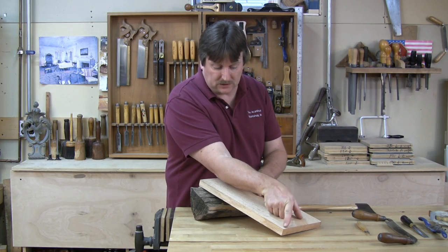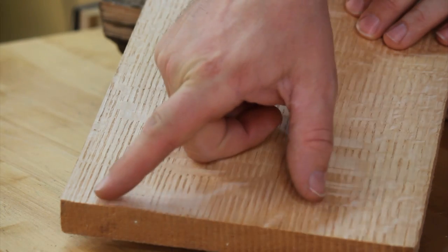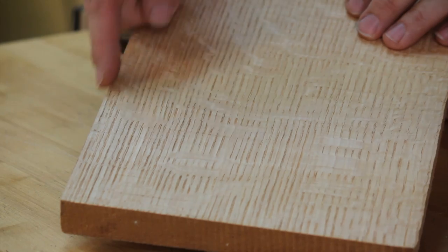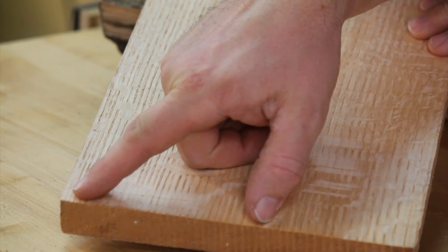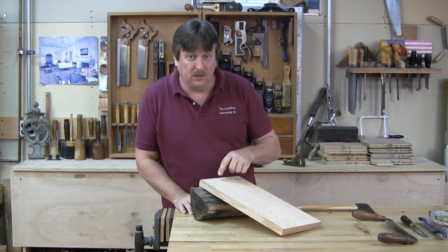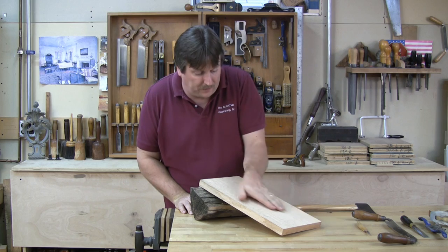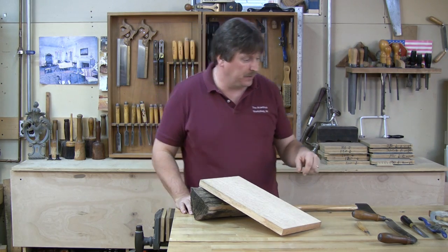And if you really look at these darker brown lines here, you can actually see that they taper off towards this edge of the board right here. In fact, this one right out here on the end, you can see is fairly wide at the bottom and it tapers up to next to nothing. What that means is those straws are generally oriented from this end of the board to that end of the board, but they're tapering sort of off in this diagonal direction this way, okay? I just exaggerated that a bit.